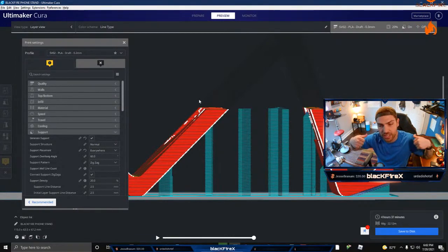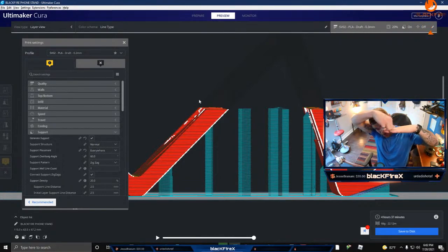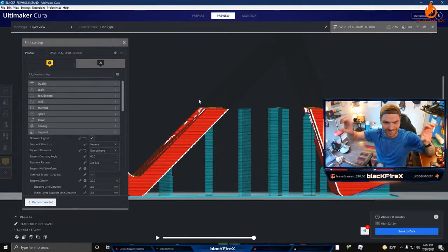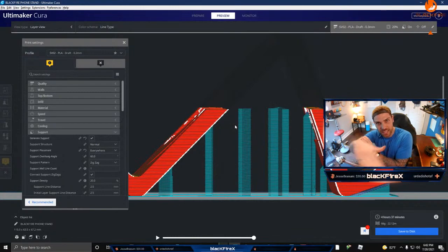That's why you watch the first layer too, because if it's going down and the nozzle isn't squeezing it out, really pushing it down onto the build plate, if it's just kind of loose, like lightly putting down what looks like a noodle, it's not going to stick. It needs to push it onto the build plate. So if you notice that as it's going around that first layer, I can go onto the printer itself, go to baby step or Z height or whatever it's called on your printer, and just by a fraction of a millimeter, go down, down, down until I see this nice layer.